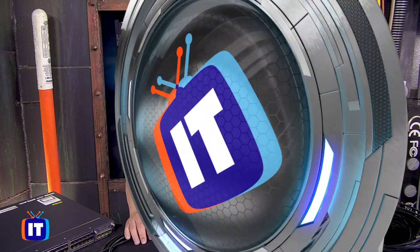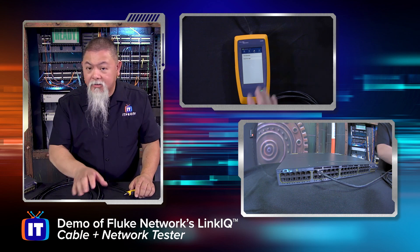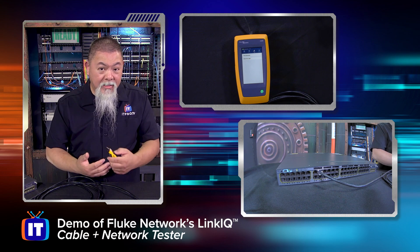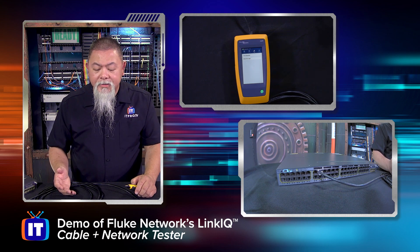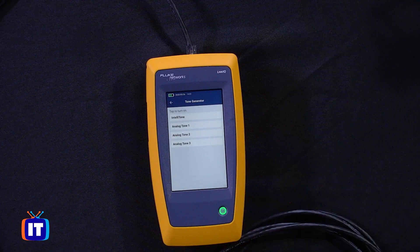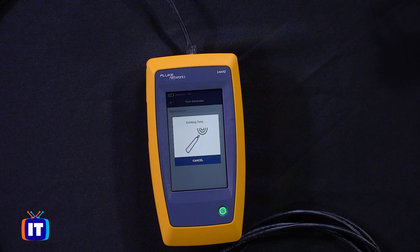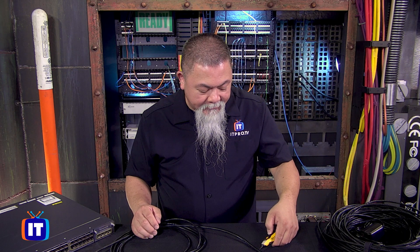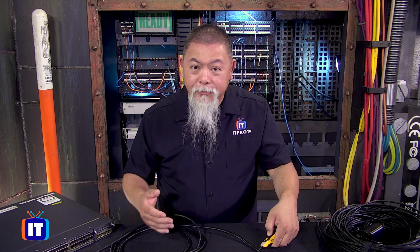One last thing I want to show you is using the probe and the toner. The great thing is this also generates a tone for us, and it doesn't matter who actually made the probe — it's fairly generic. You can use it with Fluke Networks toners, but you can also use other ones too. There's a tone generator with IntelliTone, which you can use with Fluke Networks, but also notice these other analog tones available. Instead of generating a simple tone, it generates a little jingle that you can hear. Now if I take my probe and probe the actual cable, I can hear it — it's fairly faint because of the fan noise, but it is generating a little tune so I know I'm connected to the device.